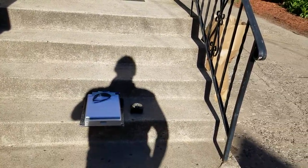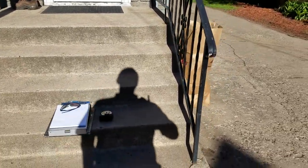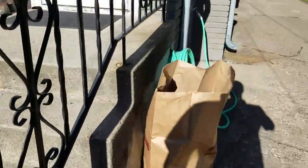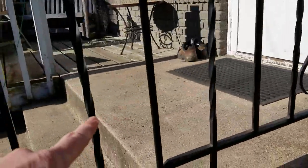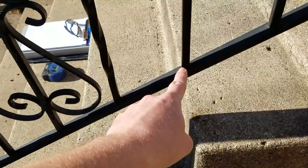On the steps, we will be removing the railings but we are not going to veneer the steps. He wants buttresses put on using 8-inch or maybe 4-inch cinder block laid on the steps themselves, so the steps on the side would transition smoothly into a buttress that goes two courses above the landing — 16 inches plus a cap. The second buttress would also be 16 inches plus a cap, going to the front of the step, done on both sides.